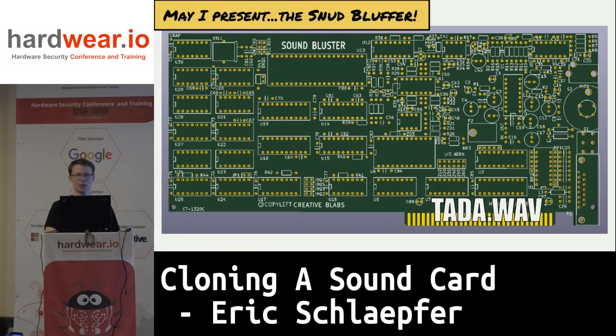Here we are with layout mostly completed. I can compare it with the original by copying the image, putting it on top of the GIMP image with transparency turned on — and if anything is wrong, like if a trace is out of place, I'll see it immediately. This one lines up, which is great. Here's the 3D rendering of the completed card, and I'm at the point where I might want to start spending money on this.